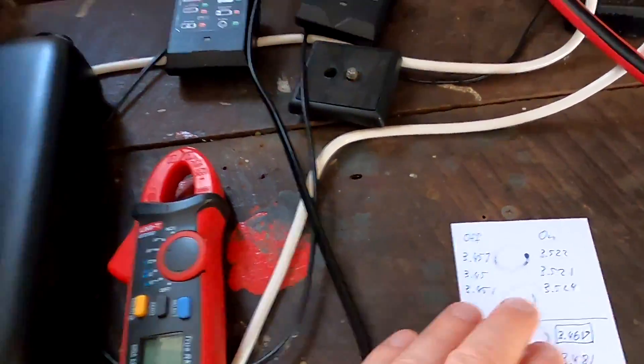So to summarize the Generation 3 Neey Smart Active Balancer test: the key thing to know is it looks at the average voltage of all cells, not the maximum, to turn balancing on or off. It's super important to understand this before buying, otherwise you'll think the balancer isn't working accurately. I'll update my website to explain this and link these videos. The verdict: is it fixed? Yes — with a small asterisk. Would I recommend buying one?